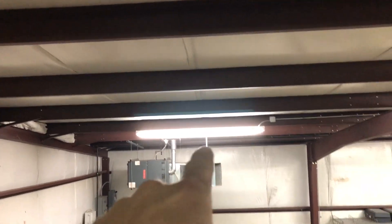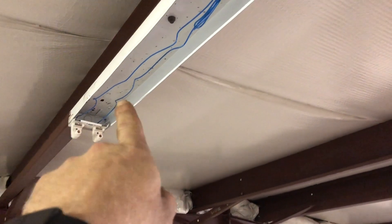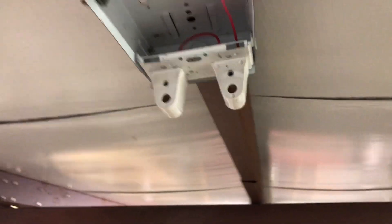We were working on that light over there but were rudely interrupted by a chimney fire. Now we're back at the station and here's how it's wired. You have the two blues going to each tombstone — no wire nut, it goes straight into the tombstone. That single red wire comes over here and gets wired into one of the tombstones, and then in between the two tombstones there's a loop done the same way, so it loops over into the other one. And then there's my power lines — my white and my black — make sure they're hooked up correctly.